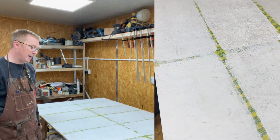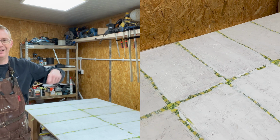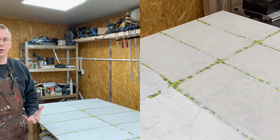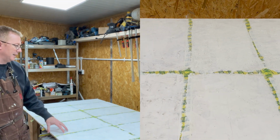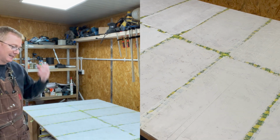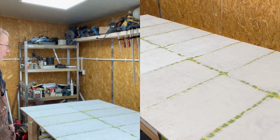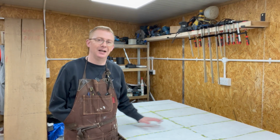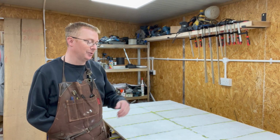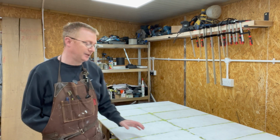Now I'll scan it along. It's quite interesting already. As I explained in my previous video, painting this stuff is nasty. It's horrible because you've got to really work the paint into it, and it soaks it up a treat as well. But it's difficult to tell that the Zinsser's very bright and white. The Bullseye and the oil-based primer obviously have that slight yellowish tint, so it's difficult to tell where it's at with that. But also the big difference, as you'll see as you go along, is the difference between the prepped, sanded surface and an unprepared surface. It was really difficult. The paint wasn't really going into it. It was skimming onto it, if that makes sense. But it's a really interesting experiment to compare and contrast the two.